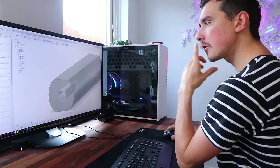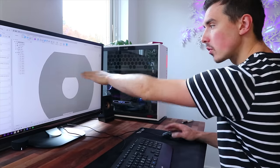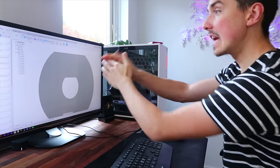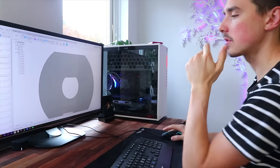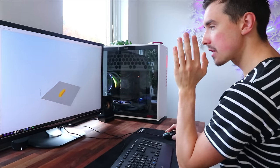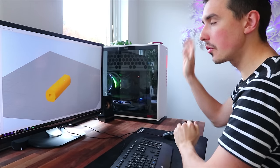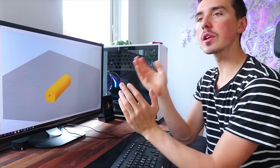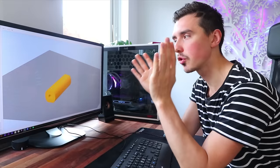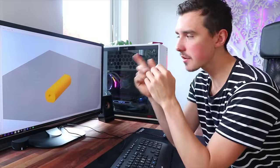You see, I don't think this is going to fail, immediately anyway. Not only will it be locked in by this level, the circle is also quite a bit smaller, so it will have a lot of gripping force, as well as being locked in. Key components. You think that's enough? We're not done. Not only will it be printed laying down, so we have the layers horizontal, it will be printed in solid TPU, which makes it basically solid, but it does have some flex to it, and it's the reason why I don't think it's gonna just shred it apart. I think this is gonna work.